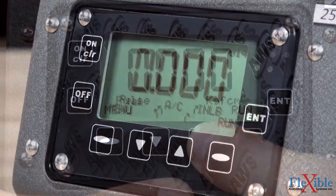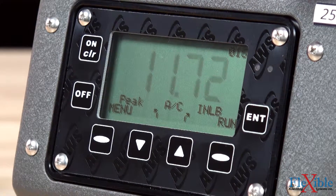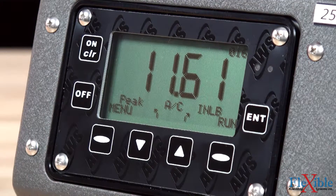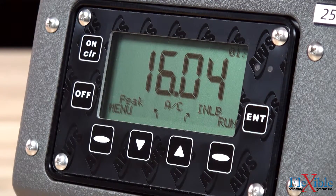The MTM modules are capable of clockwise and counterclockwise calibration and multi-point linearization, and are accurate to plus or minus 0.25% of indicated value at the top 90% of full scale on request.